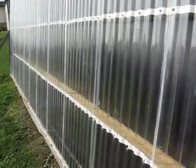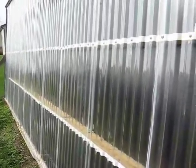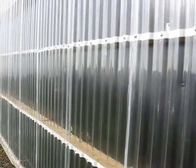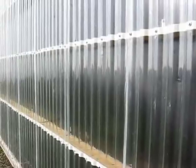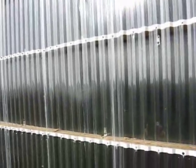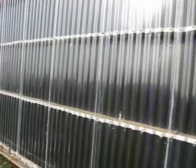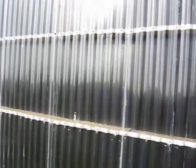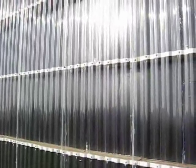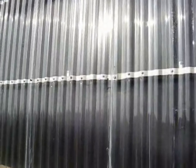I tore this box apart twice because of mistakes. The first mistake was I used aluminum on the back with Rust-Oleum paint. The Rust-Oleum high-heat version stunk terribly — it was horrible. It needed to reach 250 degrees to finally dissipate, and the highest I could get inside the box was about 210 to 220 degrees.